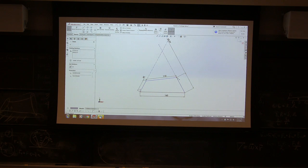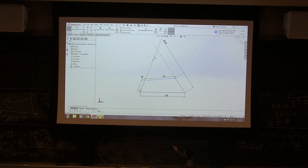And when I move these linkages, you see that the meeting point is moving around? I can actually make it perfectly go away. Come on. SolidWorks is not cooperating today, so I will just explain here. At this moment, in this configuration, this rigid body is instantaneously rotating about that meeting point, because of the rule of rigid body rotation that I explained. I'm going to just trim and then trim, and that point will stay.